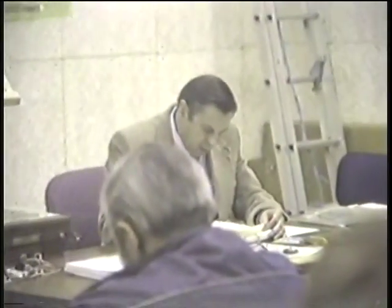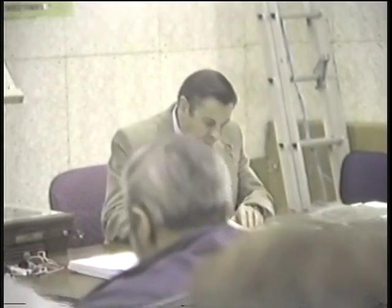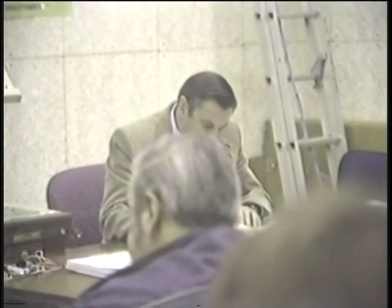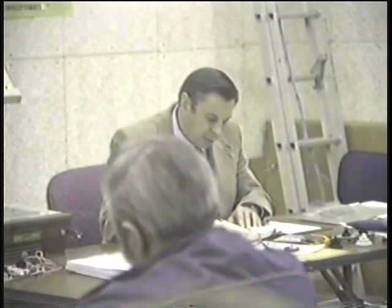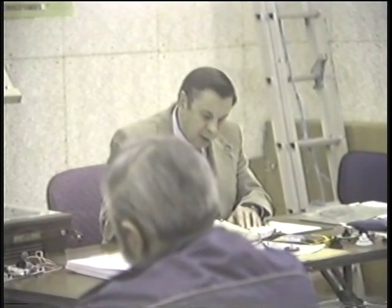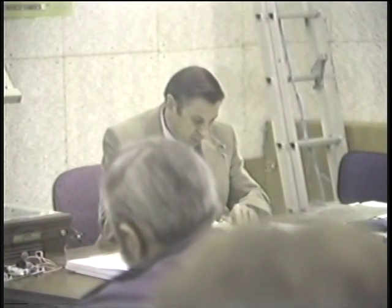All right, page 27. We talked a little bit more about the insert editing. We know all about that already. Well, let's just go over it. It says that the new information in insert editing will be properly synchronized at both the starting and ending transitions. This will result in distortion and disturbance-free editing. And I've written in there myself only in the luminance, because we know that we have disturbance in the color information.